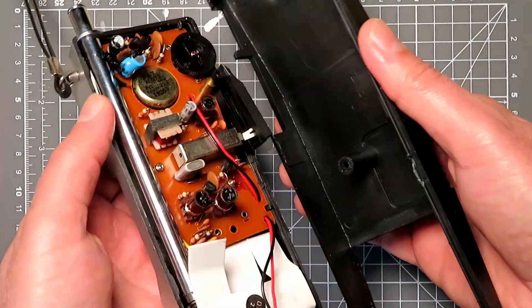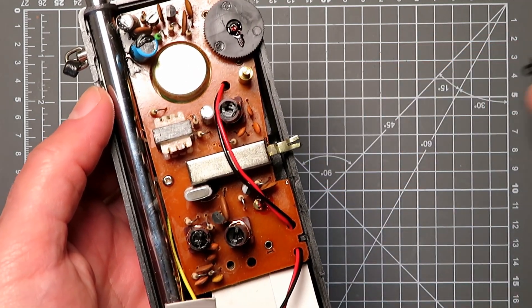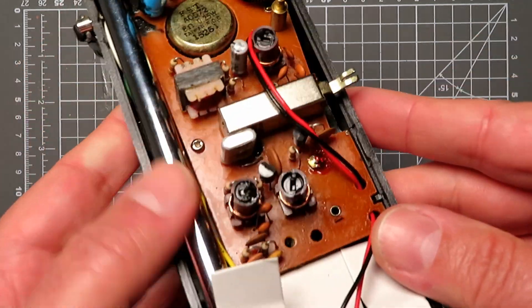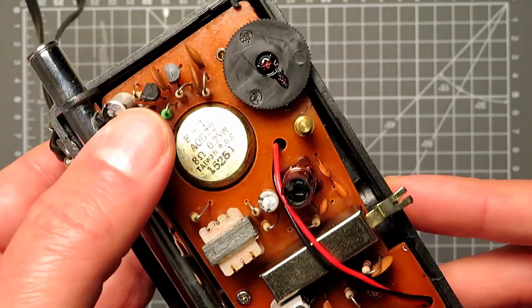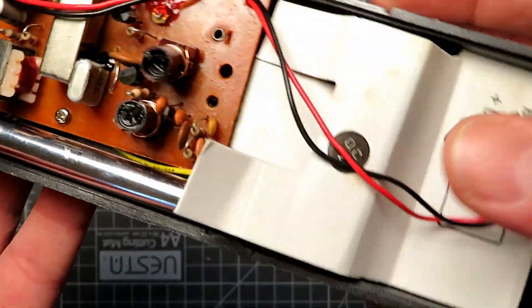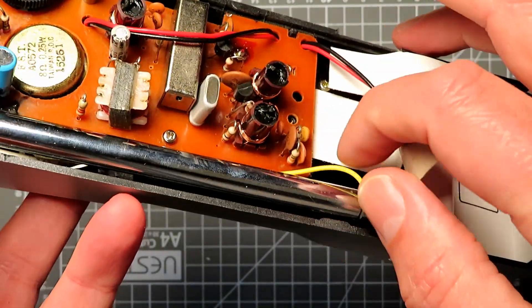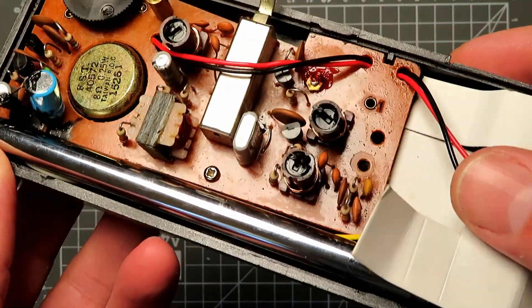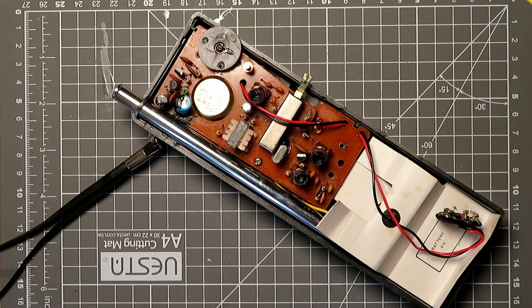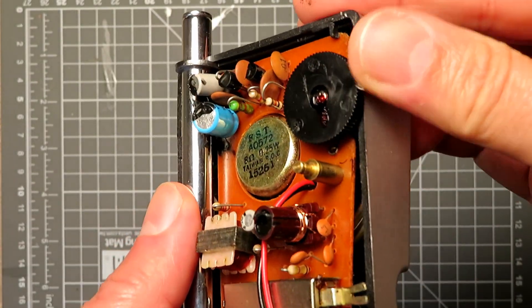I thought this one was first to be looked at — we'll see if it's done any further damage. Luckily it hadn't done any damage to the inside, which was your very basic setup you often see in these type of radios. One slightly annoying thing: they've put silicon sealant in all of the inductors, so there's no real possibility for me to tune this. I was really hoping it would be on frequency. I ran in the usual WD-40 to clean up the contacts and the PTT, popped a battery in, and had a go at turning it on.